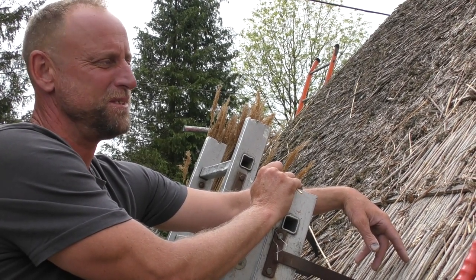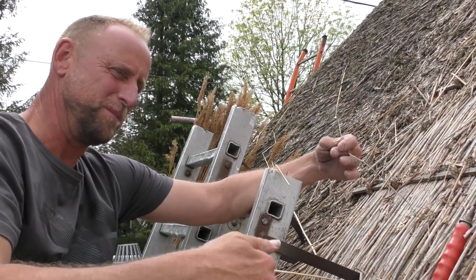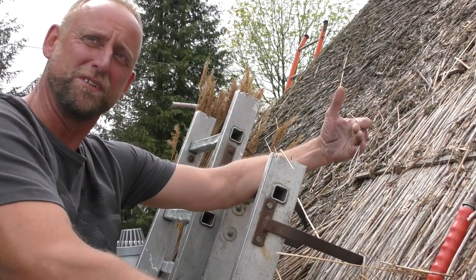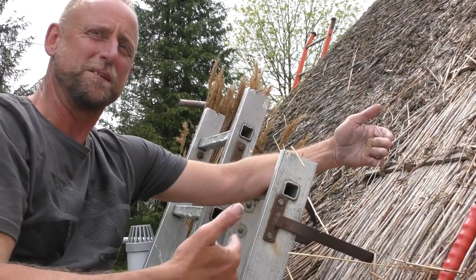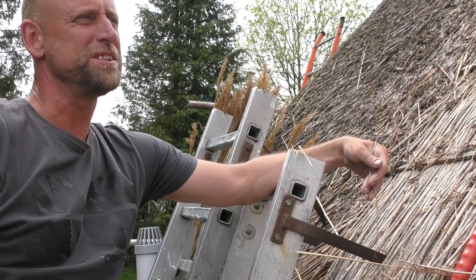The trouble with a thatch roof, if you've got valleys and stuff like that, or sides of windows that channel an excessive amount of water down, or beneath chimneys where the water running off the chimney, you sort of get double the amount of water going through it. So they would be weak spots, what you see as weak spots.